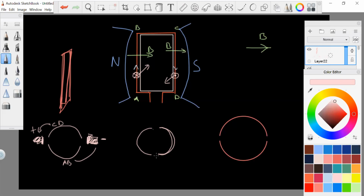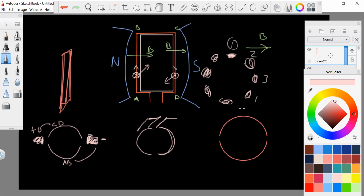Now guys, when we were discussing the motor, Shriniket had said, what if we have the magnets rotating along with the motor? Won't that be more? That is also there. What happens is the outside is actually coils of poles, and if it is a three-phase motor, which I cannot explain in too much detail, this is phase 1, phase 2, phase 3, overlapping also. When this is peaking, this is not peaking. Their AC diagram is something like this. So when this peaks, this is lower, then that peaks, then that peaks.